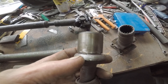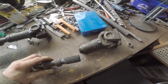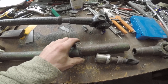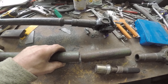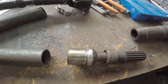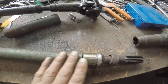I spun it up in my lathe just to square that off. That's the spline section, so that would go in there and screw on. I'll then put this bit in my lathe and cut it off there to get a nice square edge. Because I've squared both ends off in the lathe, that should push in quite nicely — it's a sliding fit, a nice tight fit, so it should come up relatively square.